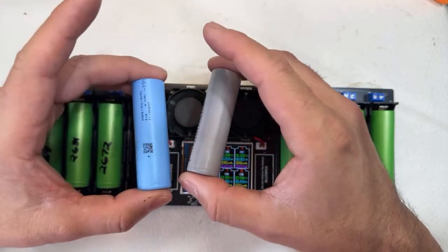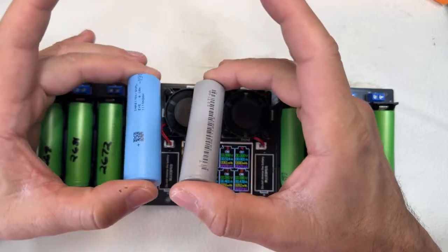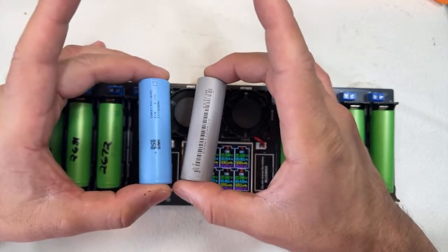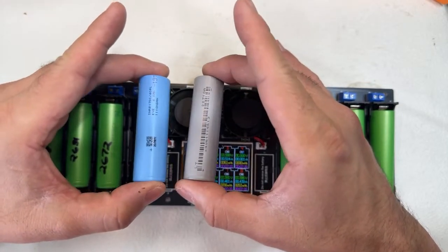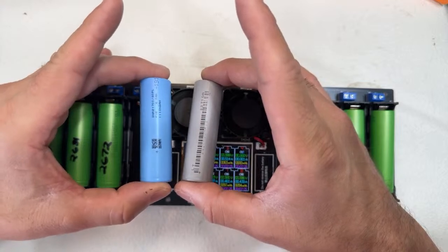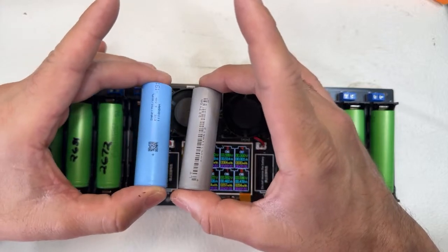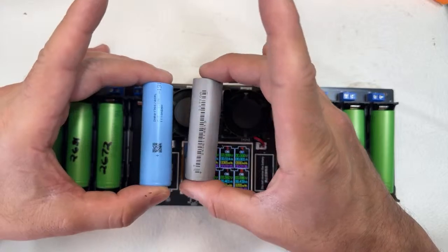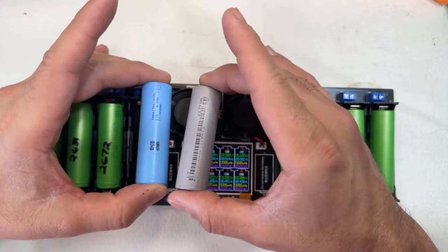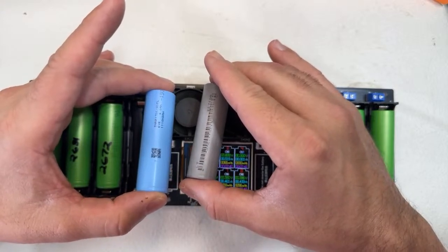Yeah, man. It's not only 70 amps. The most amazing part is that both of them are able to discharge 140 amps for 5 seconds. And I tested that, check my other videos. I was getting 108 amps per cell, and they say 5 seconds. In my testing, I left it running continuously, and that was just insane. I was getting from the JP40 over 90 amps continuously. It started at 108, and then it kept going and going. It's just amazing cells.